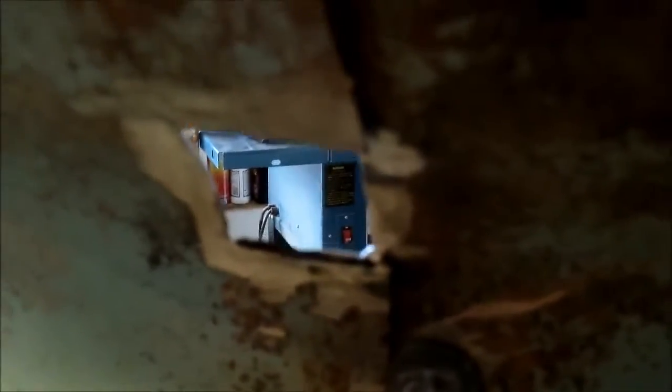This isn't a show car, but if you're going to do it, you may as well try to get it right. I got the first tack there and I've got the right edge pretty much straight. You can see I've got more of an eighth-inch gap on the back, and the bottom's a little bit larger than a sixteenth, but it should be okay. I'm going to tack the top in — I want to tack it in four places and then stitch weld it.